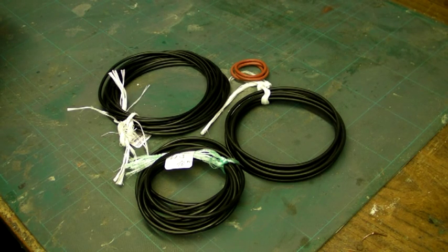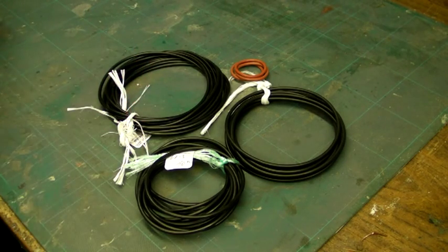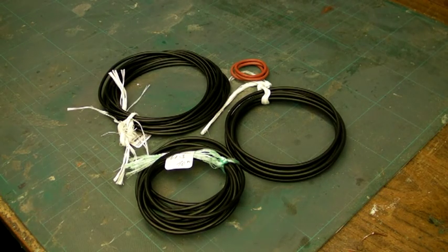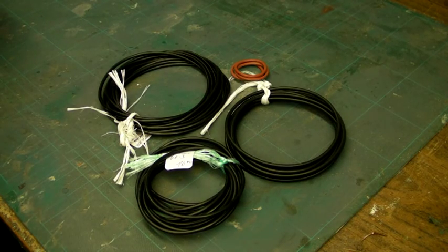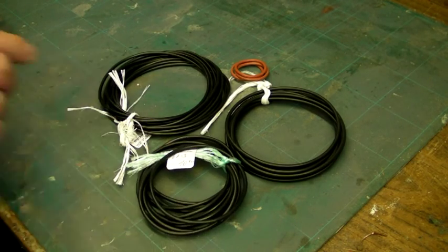The only submarine-related seller I've seen who sells them in very small quantities is Norbert Bruggen in Germany, and he only does a very limited range of diameters in those softer seals — around about 4 or 5 diameters. They're much more expensive than the harder seals. But generally speaking, the harder 70 shore seals do get the job done.